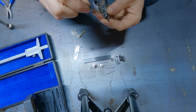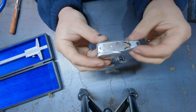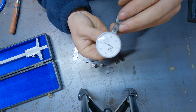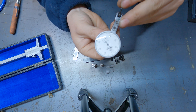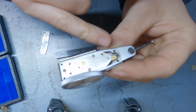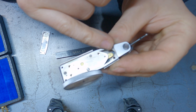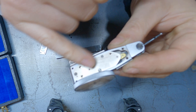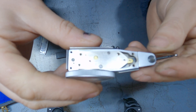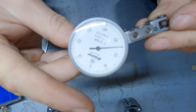Let's give that a go — I don't know how hard it's going to be to take apart. Unfortunately it was so fiddly I didn't manage to get much of that on footage, but we have a working dial! Basically what had happened is the lever in there had popped over that brass-looking arm and basically just lost all tension on the clock mechanism that operates the dial.